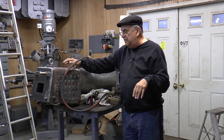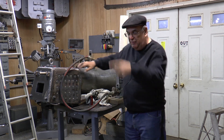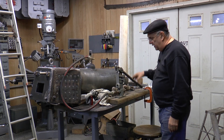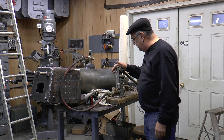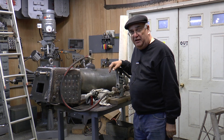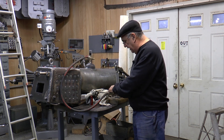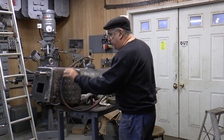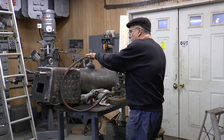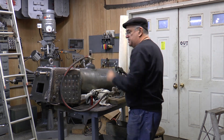This is for a K4, and it's an identical copy to the 1361 boiler, which is right over there in the other room. This is the hydro pump, and I got this off eBay. It's a regular hydro pump — they use this to test fire hoses. I rigged it up with some really good check valves, and then I have a hydraulic-type hose here, a union, a ball valve up here, and of course a pressure gauge, which is good up to 600 pounds.